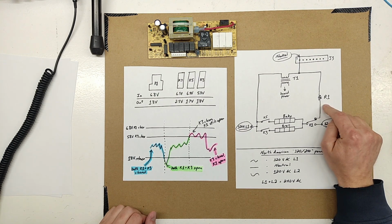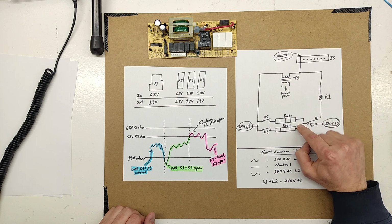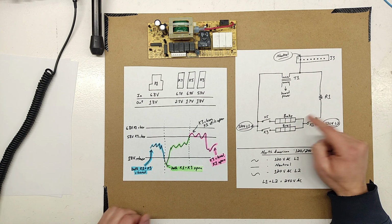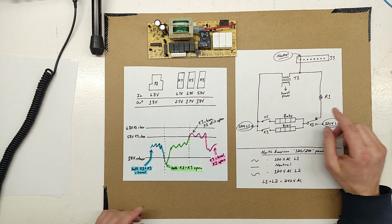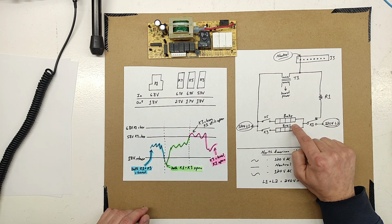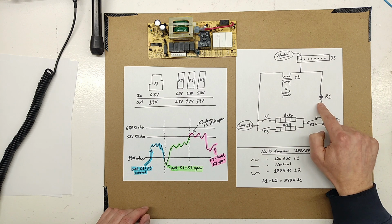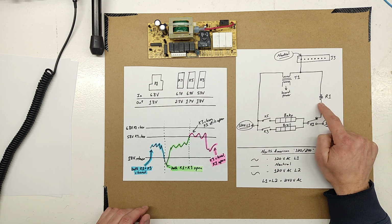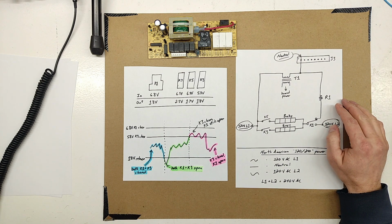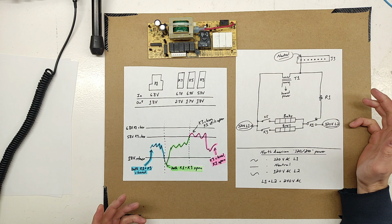I don't get the point of resistor 1. If it's there as a safety thing to prevent somebody from getting a shock when they touch these elements, or whatever, I'm just guessing here. That's a 1/4 watt resistor. If you have any form of power touch either of these elements, some fault, it takes nothing at all to overwhelm a 1/4 watt resistor, which is why it burns up, because there's a fault. So there's really no protection provided by R1 as far as shock goes.